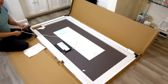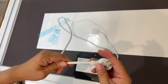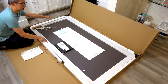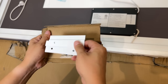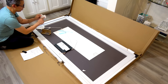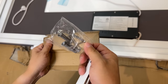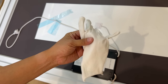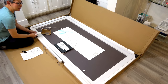From an installation standpoint you have two options: you can plug it into a standard outlet, or if you want to hide the cable, you can cut it and hard-wire directly to the power source. The frame itself is an aluminum-like material which houses all the cabling, LEDs, and wiring inside the fixture. Included with the mirror is an accessories box with the mounts that you fix to the wall — you screw these into a stud or the wall, then slide the mirror down onto them. Also included is a single white glove to avoid fingerprints, though it would have been nice to get two or four since this is definitely not a one-person job.